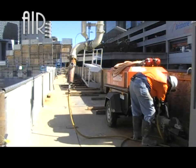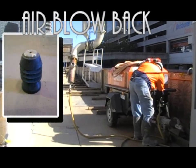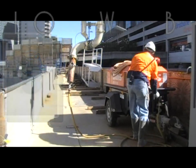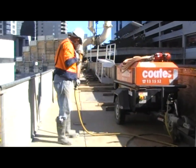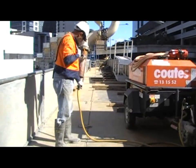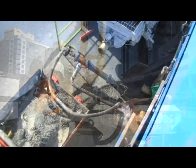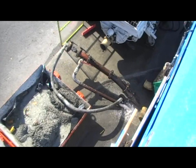We can now commence to blow back the water by air using a pig. Because the one-way and release valve is still connected, when the pig reaches the one-way valve it stops and all the water is recirculated. Air is let out of the line and the pig is recovered. The water is now diverted from the release valve through to a drainage line that goes to a quad interceptor tank system.